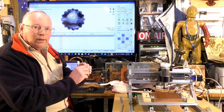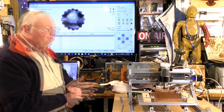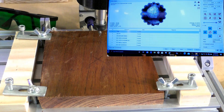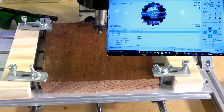This is the roughing cut, so we're going to remove as much material as we can with quite a large tool for this little machine. I'll zoom into the center of the material and do a split screen. You'll notice I have this set at 500 millimeters per minute of travel, so we're moving at 500 millimeters a minute.